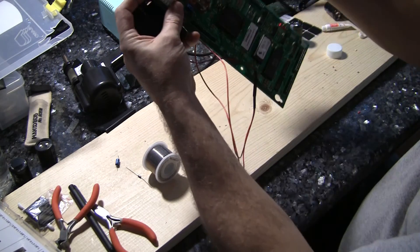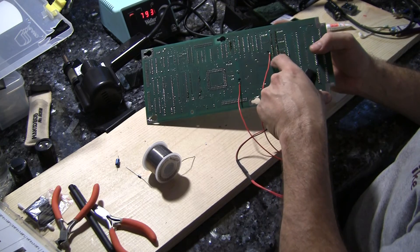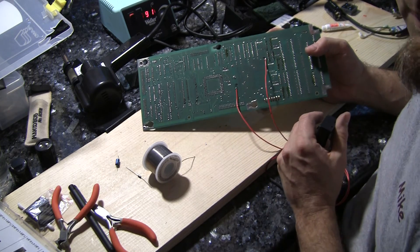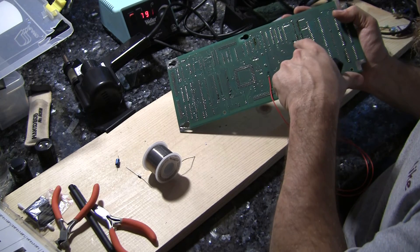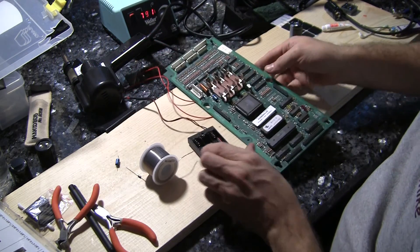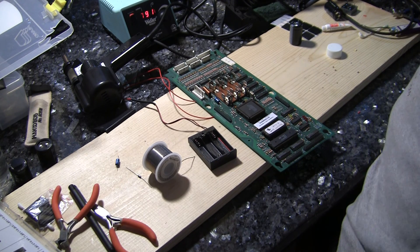We've got our remote battery pack mounted in. What I'm going to do is bust out the continuity tester and check to make sure, because there are a couple of traces next to this negative connection and I want to make sure it's not shorted. Better to be safe than sorry — you don't want to turn this on and be sending voltage down some pin that you shouldn't. Since I've got this wire being soldered and it crosses a couple of traces, I just want to make sure everything is secure. There is your remote battery holder. I hope you enjoyed this. Tune in to pinballhelp.com, leave comments on the blog, and I hope I'm providing some useful information. Thanks for watching.